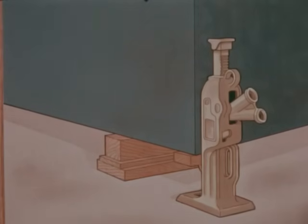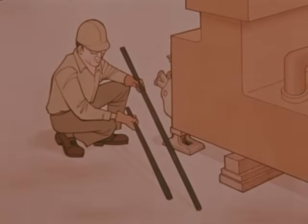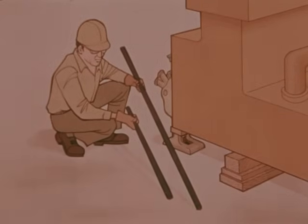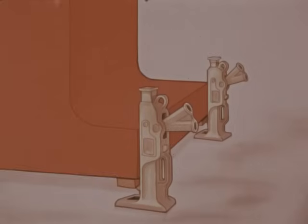This same procedure should be followed when lowering a heavy load. Always remember that regardless of the type of jack being used, it is important not to overload it. The lever or handle on a jack is designed by the manufacturer to ensure against overloading. A longer lever or cheater should never be used, as the same force exerted on a longer lever will lift a greater load. Remove the operating levers when not in use to avoid accidental dislocation of the jack and reduce the tripping hazard.